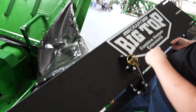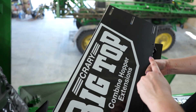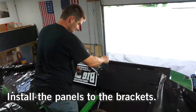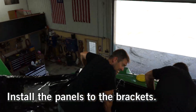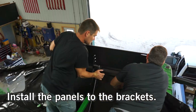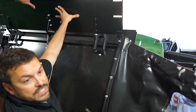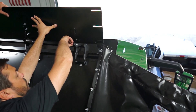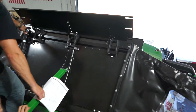This is our front panel. The distinction between the front and rear panel is the front does not have the serial number — the rear does. To keep the panel up and out of your way while you're mounting, take an Allen wrench and there are two holes right here — you can just put it in there and it'll hold the panel in place for you.